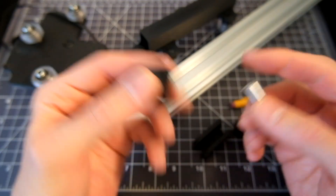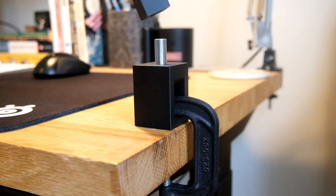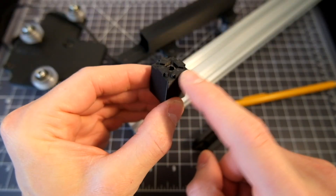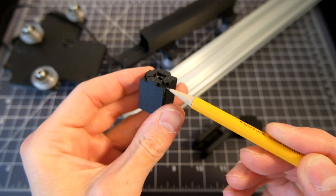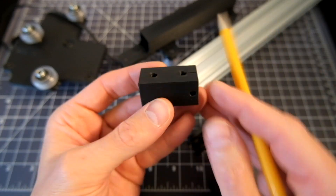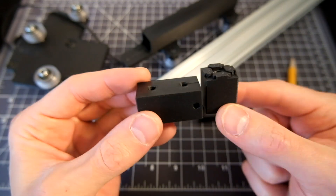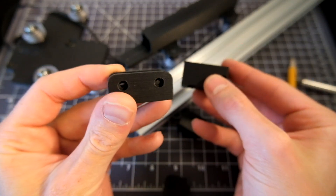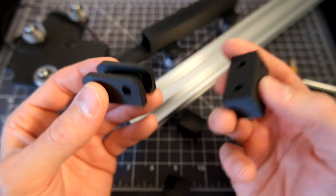The same is true for the bottom of the rail where we have the base — that's where this aluminum spacer slots into, and this in turn slots into the desk mount. This also uses a couple of tabs — a slightly different style but the same overall idea — and they have the same problem: this surface ends up being a little bit uneven. The solution is to remove those channels and use two screw holes, and now I have a perfectly flat bottom. This is a pretty simple redesign — I've just doubled up on the width of the base and the aluminum spacer just slots in. These are pretty minor changes to the pulley assembly and the base but they really add up, and I think they make the overall package look a lot more polished.